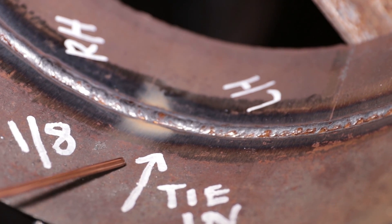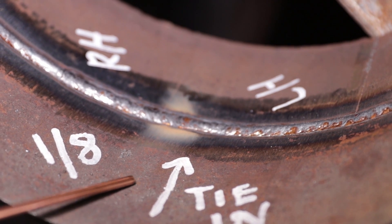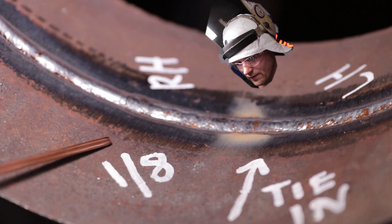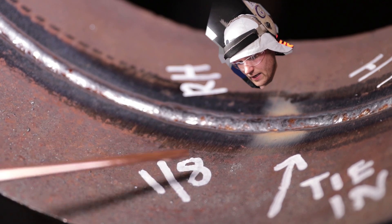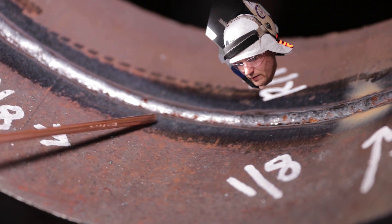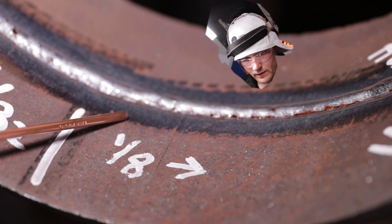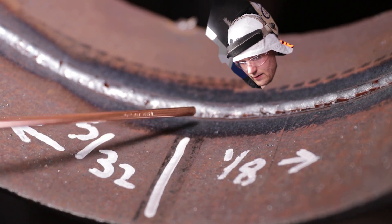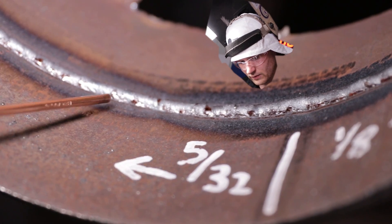This is the left-hand side — we're coming up to the tie-in. You can tell by a little bit of smoke here. We have the tie-in there; the tie-in was done with the right-hand side, which I'll be showing here. Now we have the right-hand side — about 2 inches away from where I tied in is where I ran out of filler metal and had Mike pass me more. This right-hand side is done with 1/8th filler metal to avoid build-up. I wanted the weld bead and root pass to be relatively uniform. The lower bottom portion of the pipe is all 5/32, done on the right-hand side.